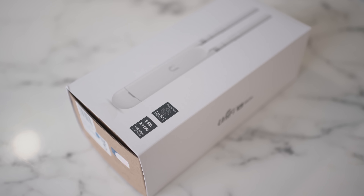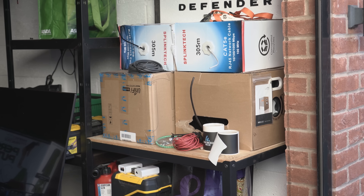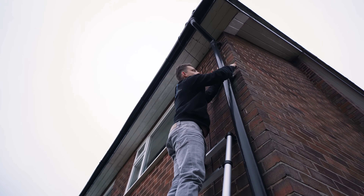The mesh unit can be literally cable-tied to any sort of pole and it's waterproof too. We're going to need a few other bits — some miscellaneous bits from the garage like a big reel of CAT6 cable, as well as some network switches for either end: the new house and the old house. Specifically the Flex switch — I really like these because they're pretty inexpensive and it has five ports, all of which are PoE. PoE means Power over Ethernet, which means you can run an Ethernet cable and have both power and data go along that one cable. Really useful for mounting devices outside, for example.